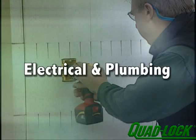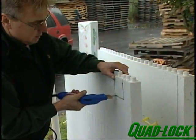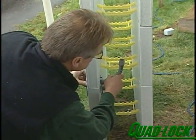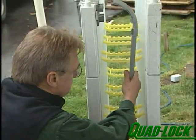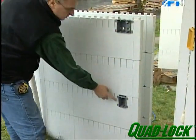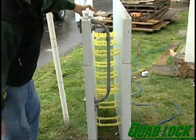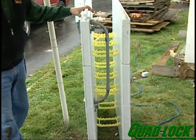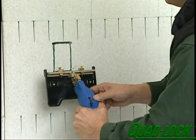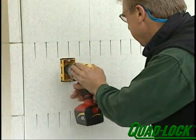For installation of conduit before concrete is poured, mark the position of the boxes, cut the foam away, and insert the plastic boxes into the wall and spray foam them into position. Install conduit runs according to your electrical layout. Contact QuadLock regarding the specially designed plastic lock ICF boxes. Electrical wiring not already placed in conduit can be added after the concrete is poured. Mark the location of the electrical boxes, cut and remove the foam, and make sure to mechanically anchor the box to the concrete.